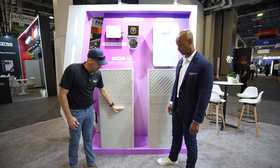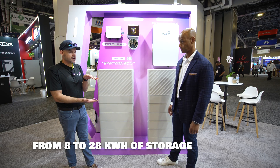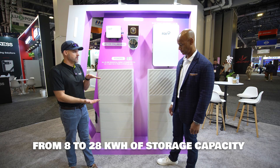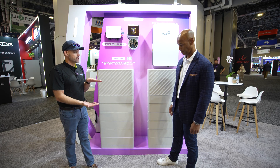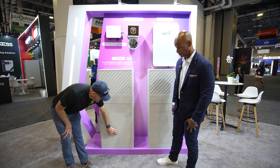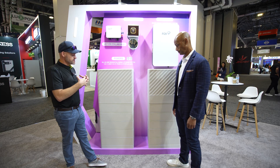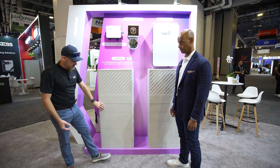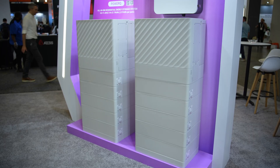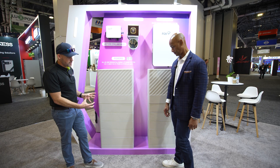It's really flexible with how much you can stack. You can stack anywhere from 8 kWh all the way up to 28 kWh. If it's in a home, you can only go up to 28 kWh because of fire code. Each one of these modules is 4 kWh. Essentially you just unpack it, stack the base up, and there are terminals that connect each one together so there's no wiring required.